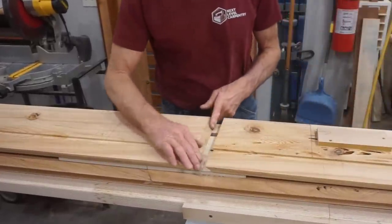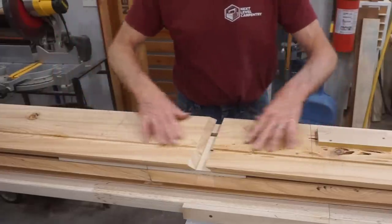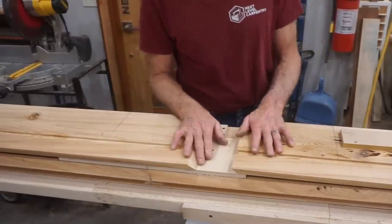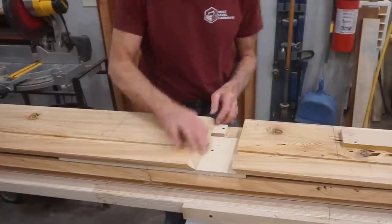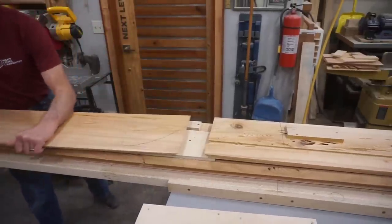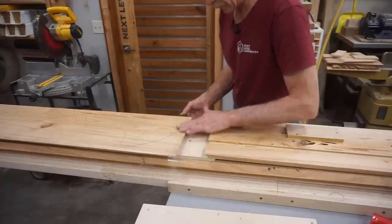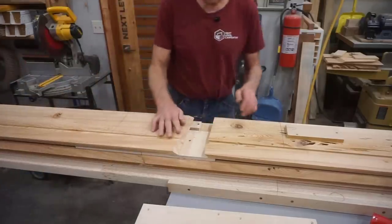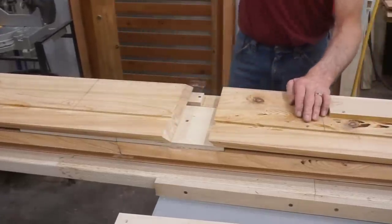And to get this hybrid joint, what I do is use epoxy on the miter and then use Titebond 3 for the splice block. And because I've got to leave all these pieces stacked up as that JB Weld cures, which takes a good 8 to 10 hours in a 72 degree shop, I flip the piece over first and use a piece of thick, sturdy, clear packing tape on the face of the beam so that any glue squeeze out doesn't glue this face to the one drying underneath it. So that piece of tape will catch any glue squeeze out as I go through this glue up process.